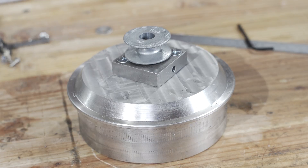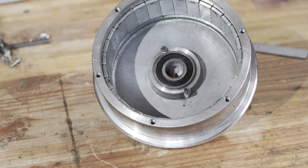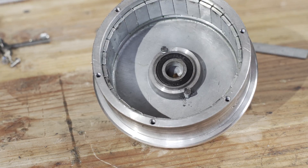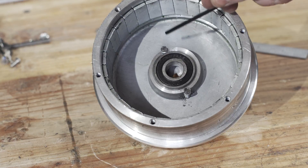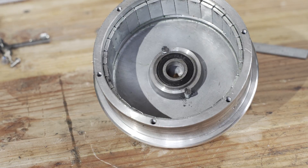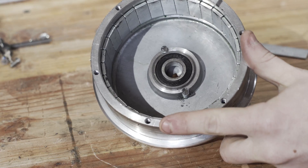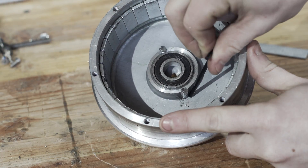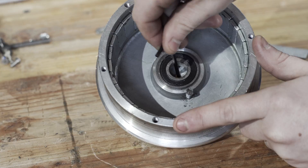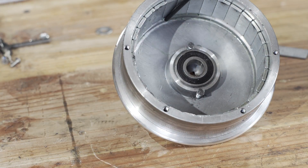It's pretty thin, which is not great for the strength of these two bolts going through. There's only maybe three or four threads that actually catch on the underside. I just missed the bearing, so that's a big problem — if the adapter plate had been larger, we could have put the bolts out further and put some nuts on and everything would have been okay. But as it is, I just missed the bearing, which means I can't really put a bolt there because the bolt would stick up and hit the bearing, and then the stator would also hit it. So we have a bunch of threads on half of it that don't contribute much strength, and maybe two or three threads at the bottom. And you can see here where I punched through earlier with the center punch — this is really thin, maybe a couple tenths. Really much thinner than I expected. The rest of it up there is quite a bit thicker, so I think it's just an uneven casting.